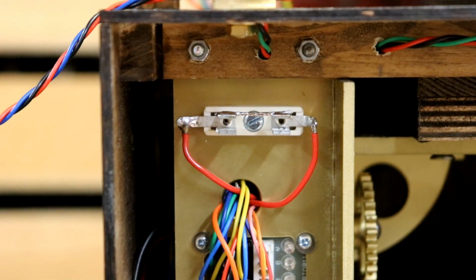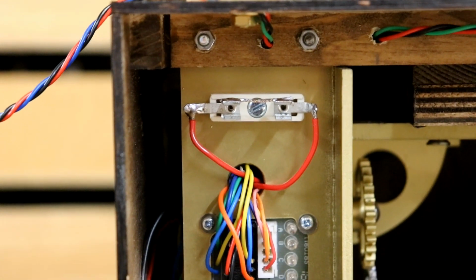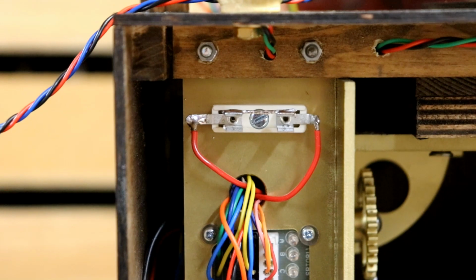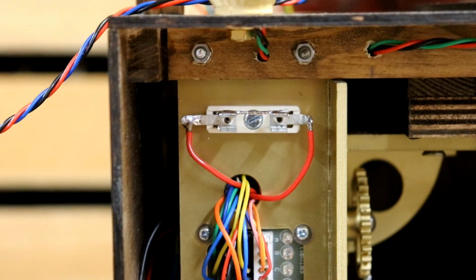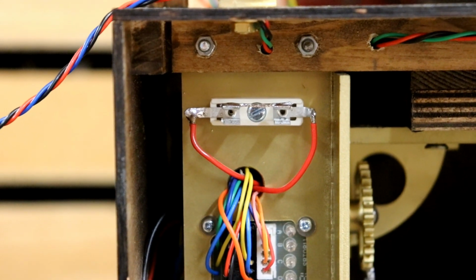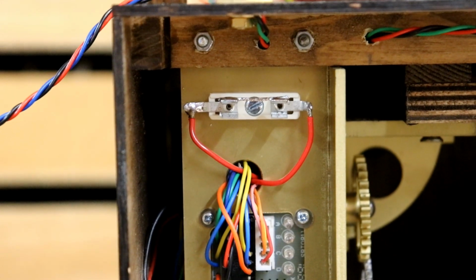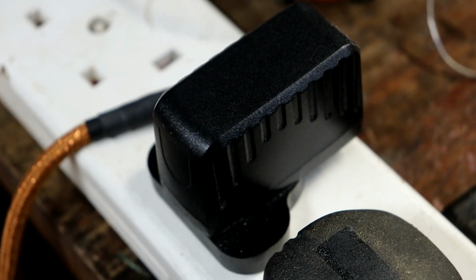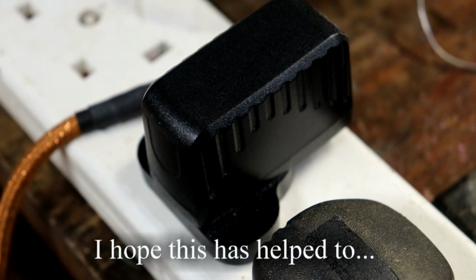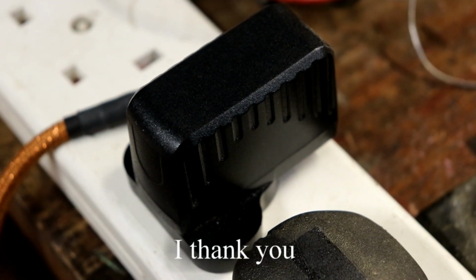So you need resistance so the electricity flowing through it creates heat and can melt it if it gets too much. But that means you end up with a circuit with all sorts of unwanted resistances in the power lines. I discovered there was quite a voltage drop across the 2.5 amp fuse that I used originally in here, and that was causing everything to drop and flicker when the sound got too loud or when the flickering lamp was working. So I ended up getting rid of it. The fact is, if you use these switch mode power supplies, they have over and under voltage and current protection anyway, so they're pretty rugged and safe.